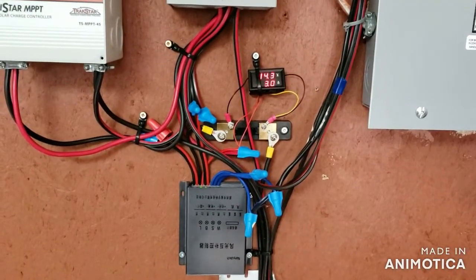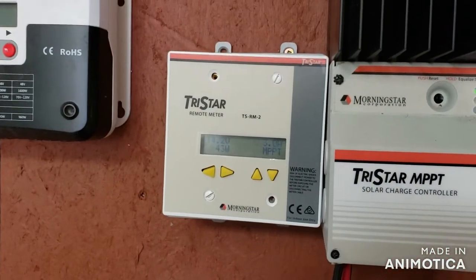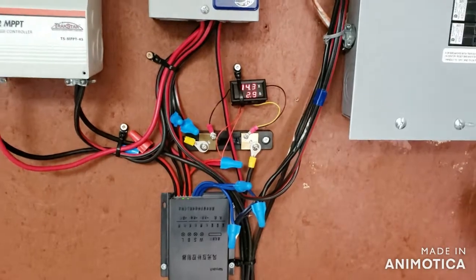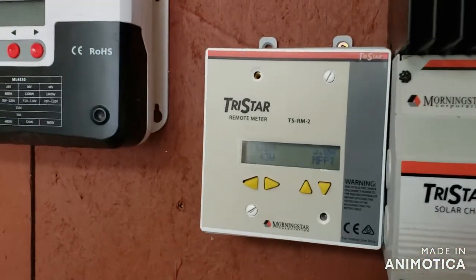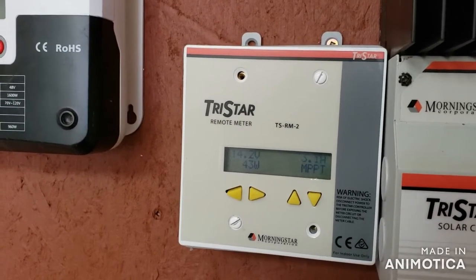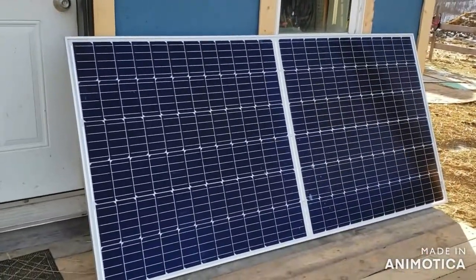Back inside, the hybrid wind controller is putting out 3 amps at 14.3 volts. Over at the high-voltage panels, they're putting out 14.2 volts and 3 amps — the same amperage. The smaller panels are producing exactly the same as the larger panels right now, and that is because of the shading. The shading is only allowing about 43 watts of the 600-watt capacity into the batteries. Relocating those panels higher or fixing the shading problem would be a big solution. We also have this bifacial unit — we're going to make a wood mount and get it up on the roof.